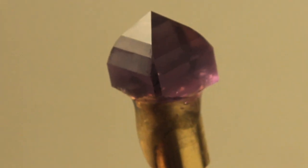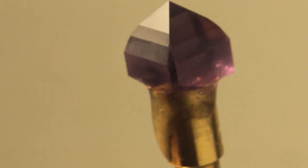And the problem with toppers is they're a thin metal lap impregnated with diamonds that's only that thick. This is a 1200 lap. And the problem is they're not perfectly flat. So they kind of vibrate a little bit, especially near the ends. And that causes the stone to not have an even facet.